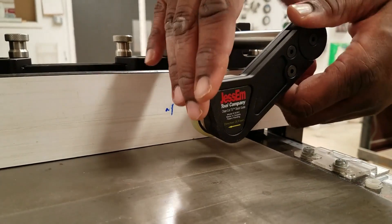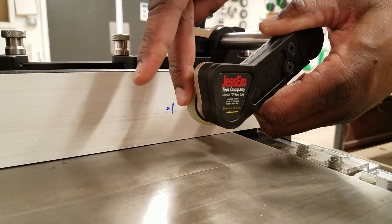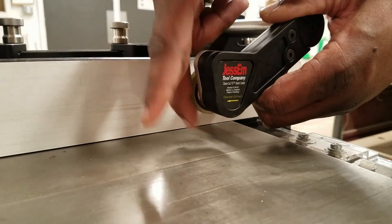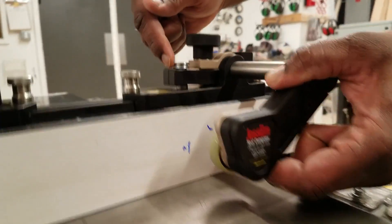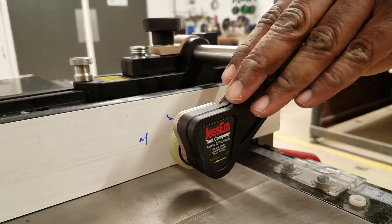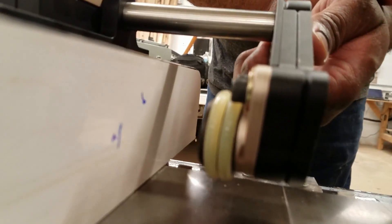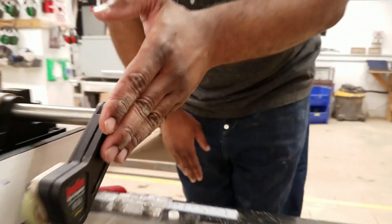As you see here, we have the entire piece. Now, we have the black portion, which is part of the hole. The green wheel, as you see here, only spins in one direction, which allows you to slide firmly without worrying about kickback, as it locks if it tries to go the opposite direction. Another thing you'll notice is that there is a spring mechanism here, which allows you to move the stock underneath the roller and keep it firmly affixed. There's one more fantastic feature: these wheels move at a five degree angle toward the fence, so worrying about keeping your piece against the fence constantly is not so much a concern as it had been previously.